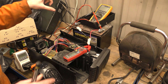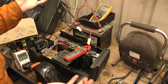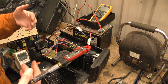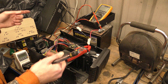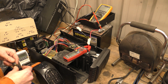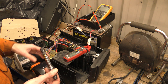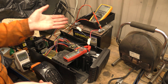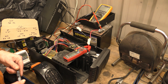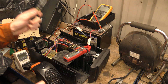As I say, I'd like to build all this up and have it connected to the power supply for the diesel heater, then kill the power and have either the afterburner or a voltage sensing relay to turn the fuel pump off and shut the heater down. But I just wanted to see if I could turn this dead Uninterruptible Power Supply into something useful — and it appears, yeah, you can. Just rip out the old batteries and either find a leisure cell or old car batteries. Old car batteries work, and if they're free, they're free — don't spend money if you don't have to. That was my kind of goal. This works. It's a bit of a mess and I need to tidy it up and put it in a box, but it does work. Thanks for watching!